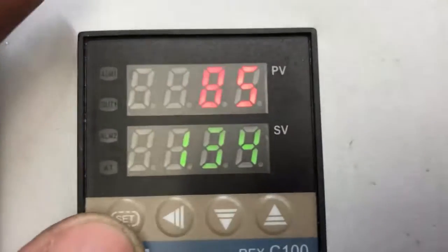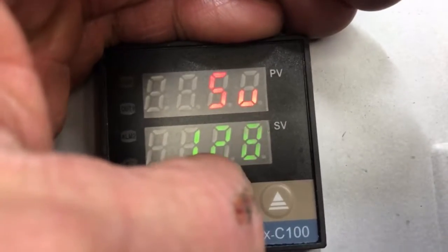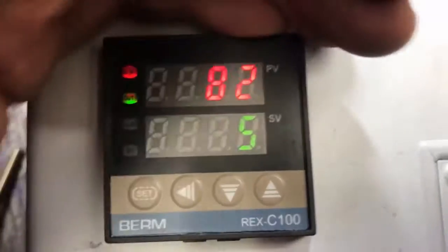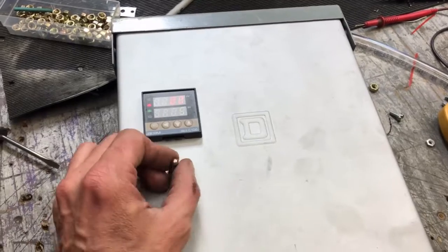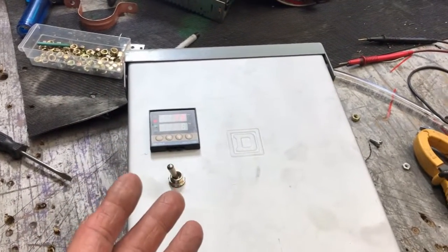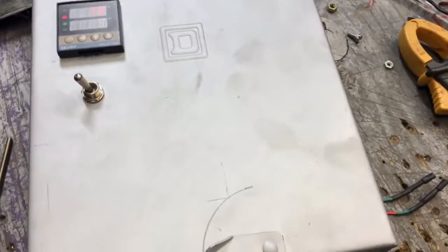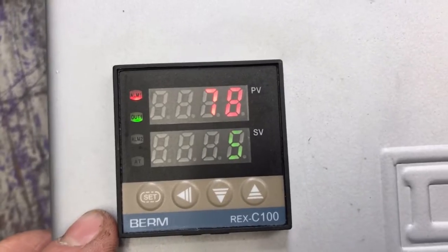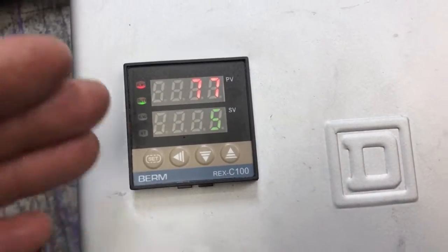You can hear the valves activating as I've set things, because now we are below the operating temp. This jumper switch knocks that stray voltage off the solid state relay — if you have a constant voltage on the solid state relay it won't fire. The system will come already set up and everything should be stored in it. If for some reason it erases, I'll show you how to set it up.